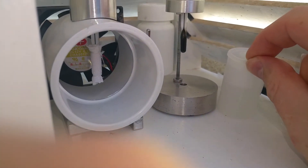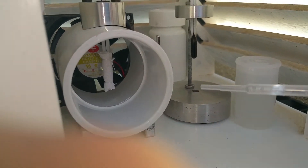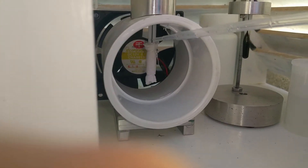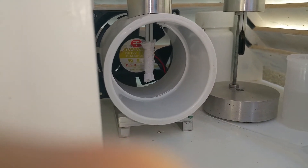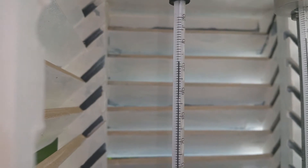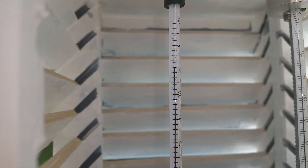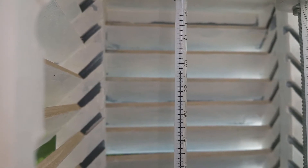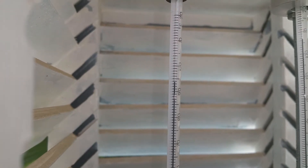I have my distilled water in this film cap and I use this little pipette to wet the wick. Turn on the fan and you'll get a wet bulb reading. I've wetted the wick — let's turn this on and you can watch the mercury in this thermometer sink as the air is blowing past it and it's measuring the temperature of the wick. I hope you can see that in there.